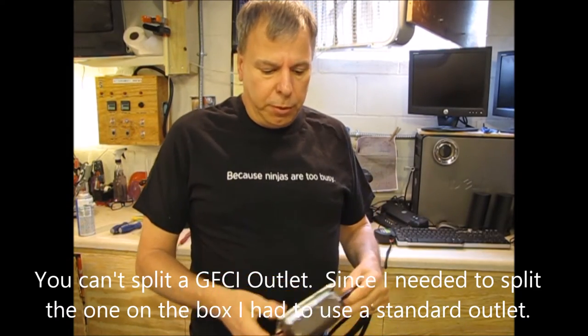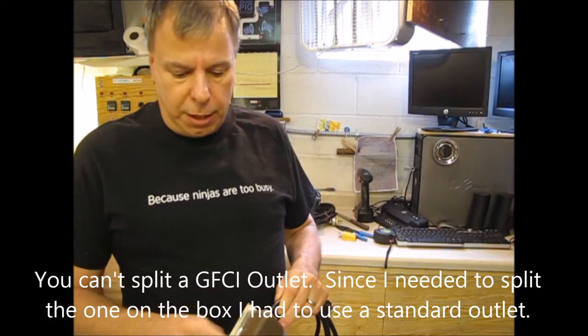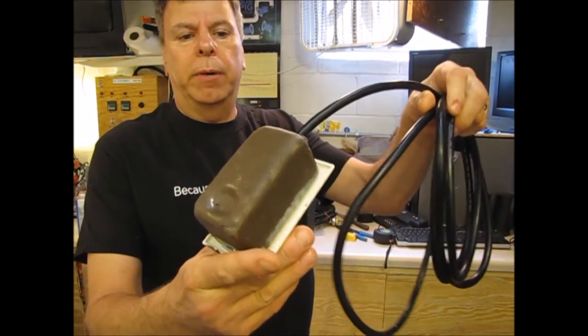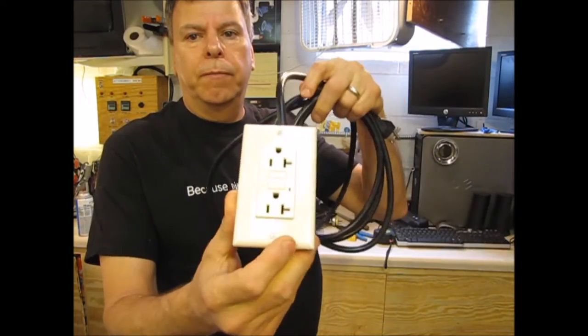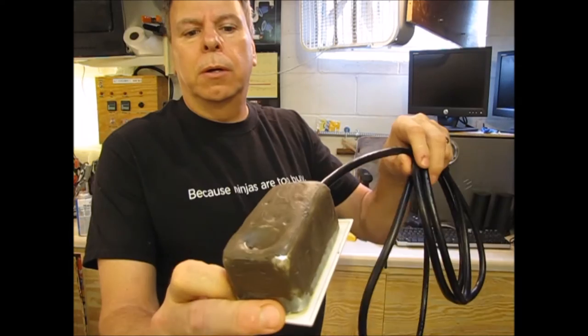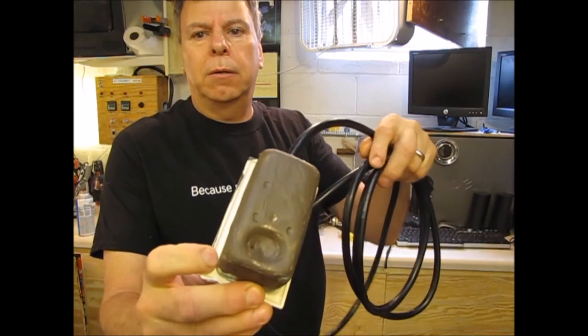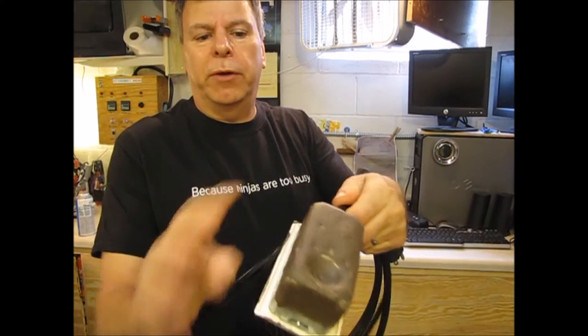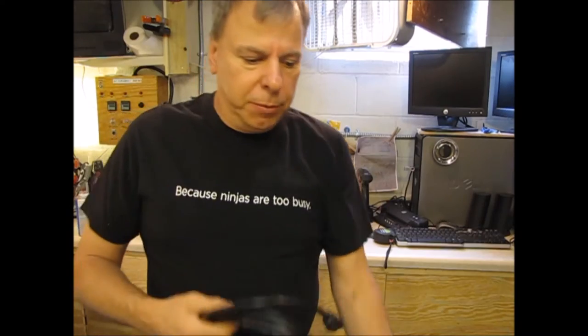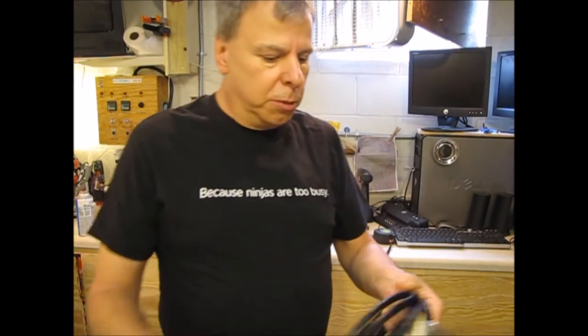So what I've done is made an extension cord with a 20-amp GFCI outlet built in. Pretty straightforward project. Anybody who's put an outlet in knows how to wire an outlet on the outside of the metal junction box. I just took some silicone caulk and put some on there, wet my fingers, and rubbed it around to seal that up a bit. It's not watertight, but if it was sitting on the ground it wouldn't get into the bottom of the junction box.